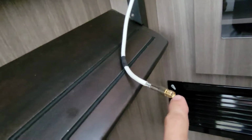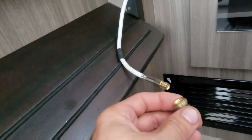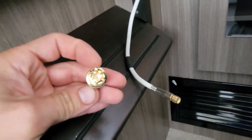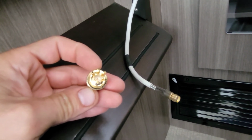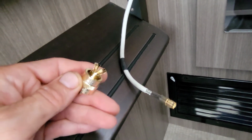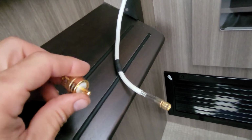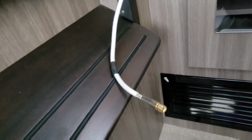If you don't crimp it perfect and you don't get this connector perfect, it's not going to work very well. So I always use these, so we'll cut this end off and we'll put these on. If you look on the inside here, that's actually a pin that stabs into the wire, so no matter what you get a connection. And then the outside, it's got all these sharp blades here, and those will stab into our ground. So I've never had a problem with one of these things. They always work. So let me switch this out, and then we'll double check our batteries.